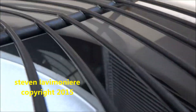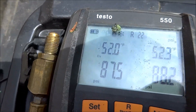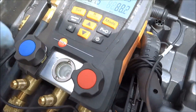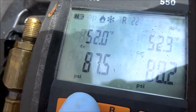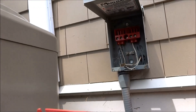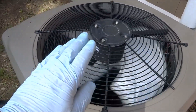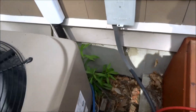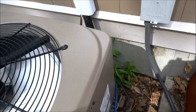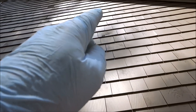You can see it's a micro channel in there. I was here last year — the thing's got a leak, it's out of warranty. It's probably 80 degrees out. Starting it off to see what it does. She needs a new unit. She said she ran it all day yesterday and it didn't cool, so we'll see. Also, the previous guy reduced the three-quarter line down to this plastic to run it into this line here, so I'm going to have to drill a new hole and run a three-quarter line down on the side of the house.